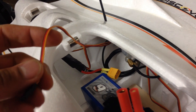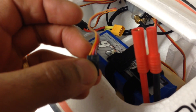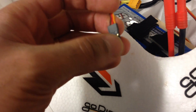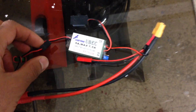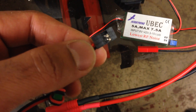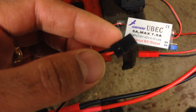So I'm not going to use the 5V power that comes out on the ESC that you typically plug into the throttle channel. All I'm going to do is take the signal wire from the ESC — not the 5V and the ground. I'll just pop out the little connector, tie off the 5V wire so I don't use it, take just the signal wire, and in the UBEC there's 5V and ground already there. I'll put the signal cable from the ESC in there and then plug that into the throttle channel of my receiver.